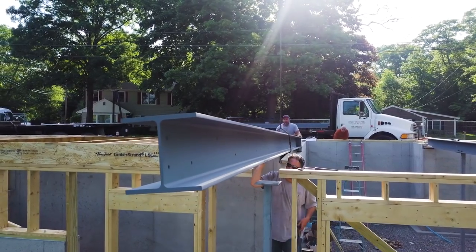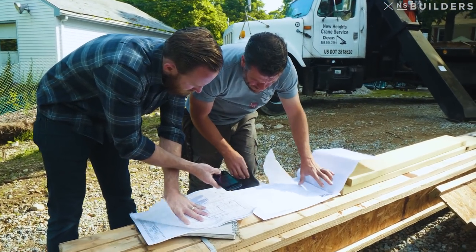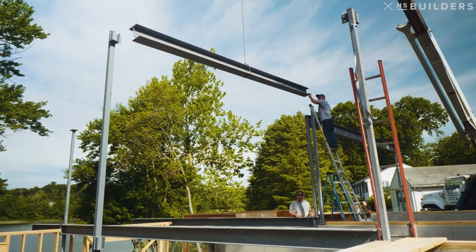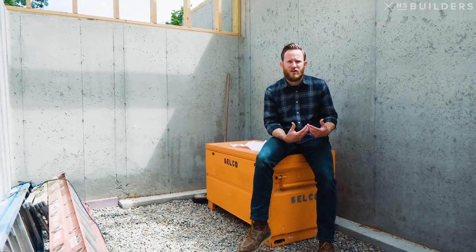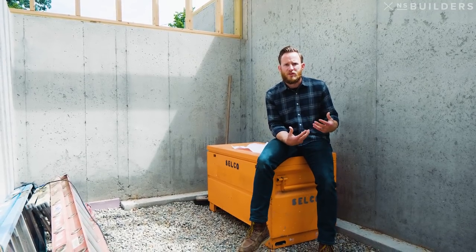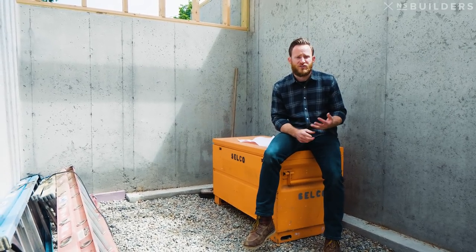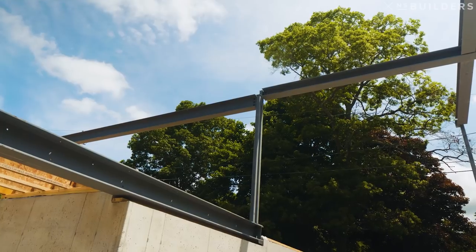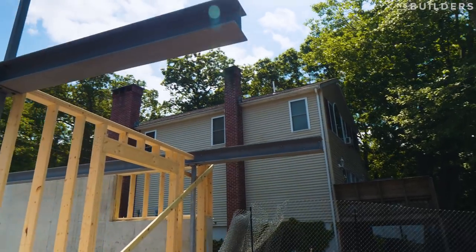Before we get into the fun stuff of actually erecting the steel, we spent the last couple of weeks working with our steel fabricator on the shop drawing process. We take our architectural drawings and our structural drawings, overlay them, and then figure out the best way to fabricate and erect the steel on site. From there, we produce shop drawings that we then reviewed with the engineer and architect. In this project, we actually ended up relocating some of the posts so they weren't in the way of future walls or creating a weird bump-out at the entryway. The shop drawing was drawn the way it was done on the architectural, but it didn't work in the field. So we went back and forth until the architect signed off on our shop drawing process — then it goes into fabrication, we schedule a crane, and we start erecting the steel.